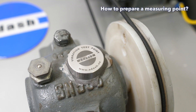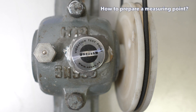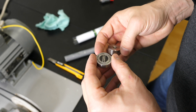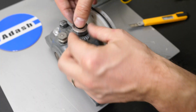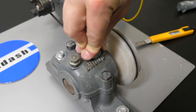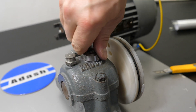To obtain quality and repeatable measurements, you should prepare your measuring point on the bearing housing. The best way to do this is to fit all measurement points with measurement pads. A measurement pad has a flat ground surface made of magnetic stainless steel, and it is connected to the machine with a special glue which has metallic properties when dry. This ensures good vibration transmission.